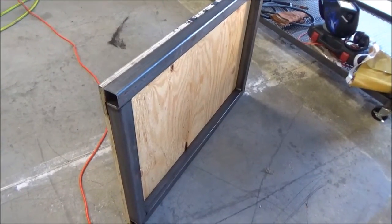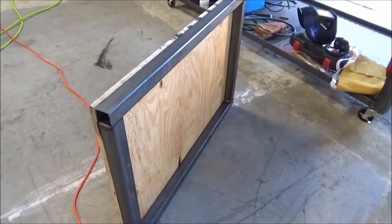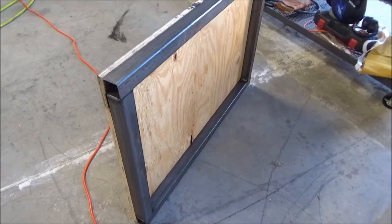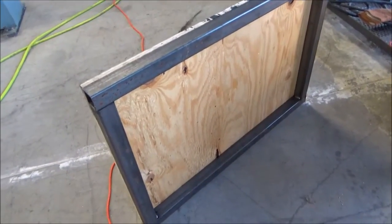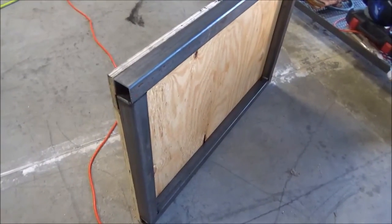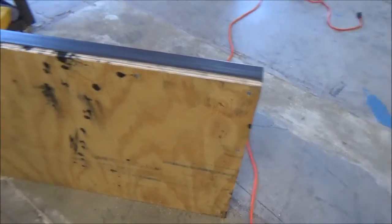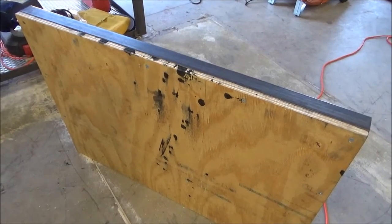This is officially the first platform for the first plug for the Raptor. It's going to be two pieces and it'll hold the top outside skins of the doors above the windows. It's 44 by 30 inches. I just cut the steel for this — two by two steel — welded that together quickly, put the plywood on there and screwed it on with some self-tapping fasteners. The next step will be putting some foam on that and cutting it in a little while.